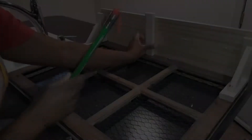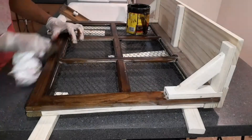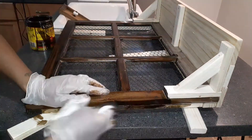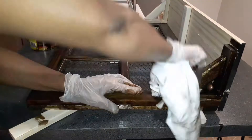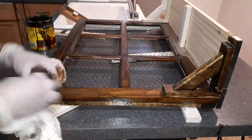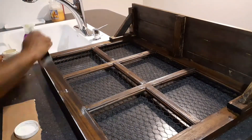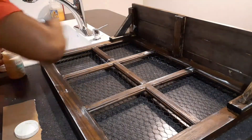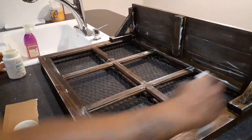I took another piece of square wood, measured it for the middle for extra support, glued and nailed it down. Then I used my favorite stain — dark walnut — I love this stain, everything in my house is stained with it. Once I let that somewhat dry, I went in with some ivory chalk paint and dry brushed the whole thing to my liking. After that I sanded it down because I wanted some of the original wood to show through to make it look old, rustic, antique, vintage — all that.